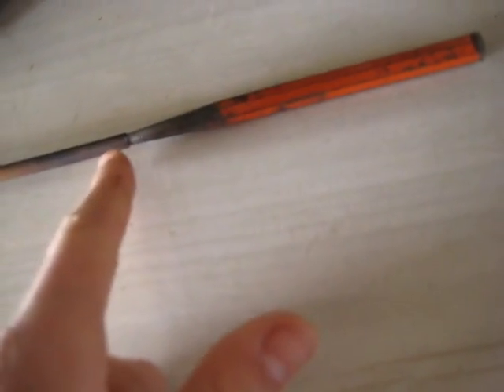I've got to try and hold this in the vise somehow without squashing it too hard, and just push this in with a hammer until I get the desired size. Then I'll solder it on and work out the bends. I'm going to drill a hole in here and stick that in there — that's going to be a challenge to solder that in without making too much of a mess, because this has to be pretty damn clean. Either way, I've heated this end up with a blowtorch, got it hot, so it cooked all the crap and the paint off. Then I went over it with sandpaper, but I'm going to use one of those bench grinders with a wire brush wheel on it — that would finish it off even better and make it pure so I get a really good joint. So yeah, I'll clean it and solder it and show you.